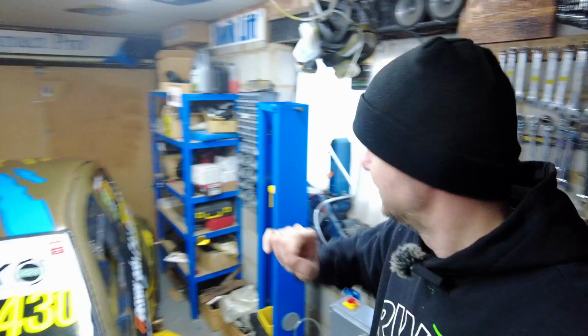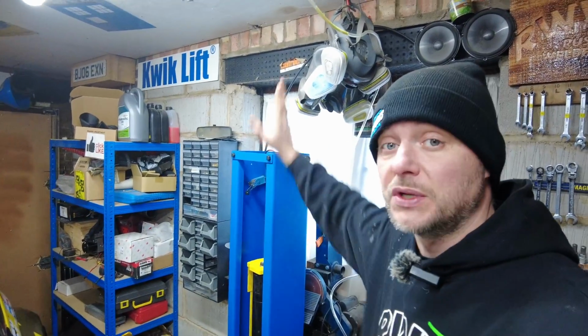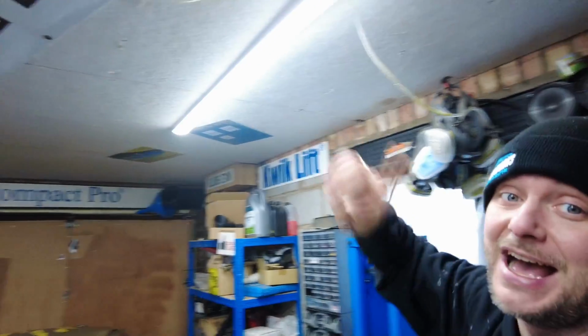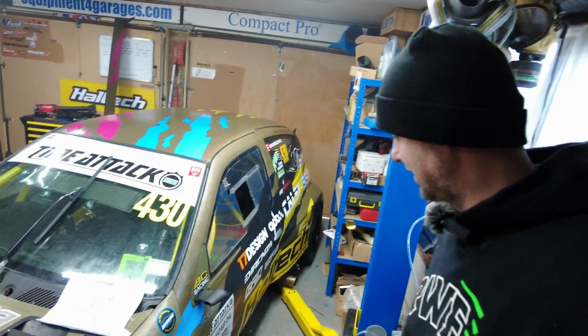One thing I forgot to note. When you install this and when you're doing the adjustment, the master column needs to go all the way up. Only when it reaches the top position, it starts running fluid to the second one. Because of the ceiling, I was unable to do that in here. So what I did, I unbolted them, I tilted them at an angle so they can actually fully retract. It was a bit of a MacGyver moment, not MacGyver, redneck moment, but it worked. So they basically extended fully and then both of them working. So now we can try and lift it.